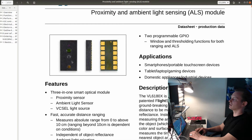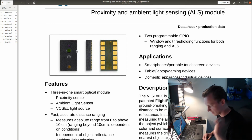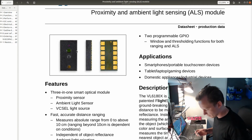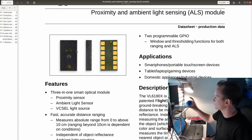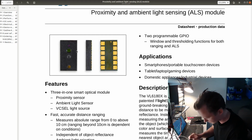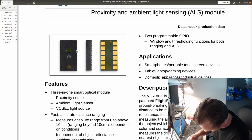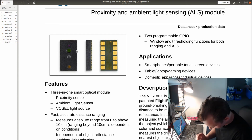It's a tiny sensor that melts past 260 degrees. So I have to keep the hot air at maximum 260 degrees. I cannot go beyond that because then the sensor melts. But I'm going to make sure that I have enough flux on the pads where the sensor is going to go, so I get some decent solder flow there. And then I'm going to preheat this a little bit so that the flux melts. And this flux, I apply it with like a Q-tip thing, so it's a bit messy, but it works.